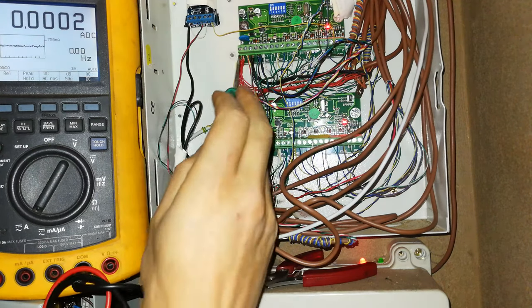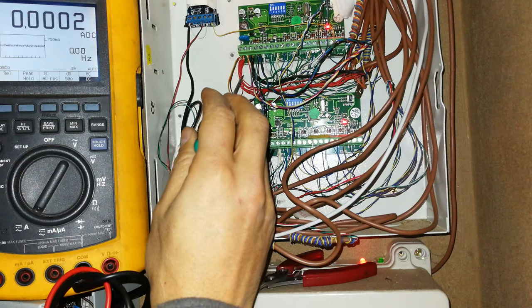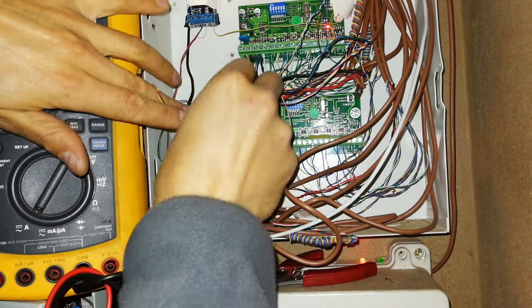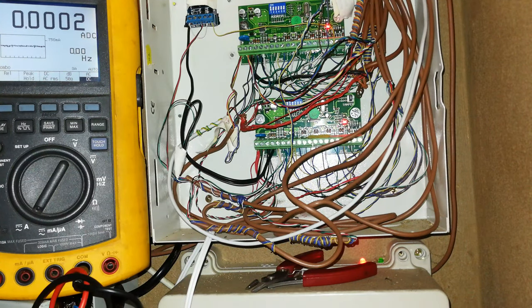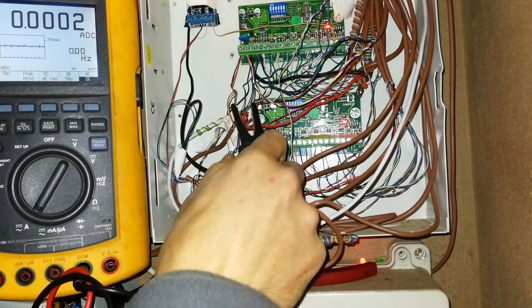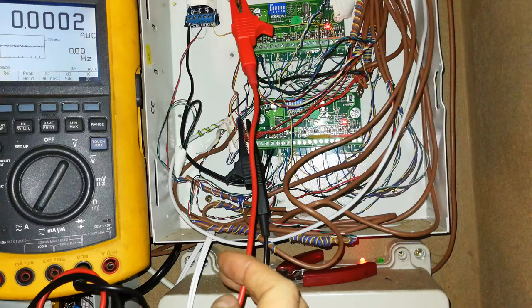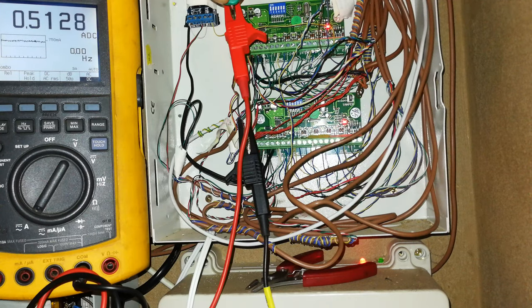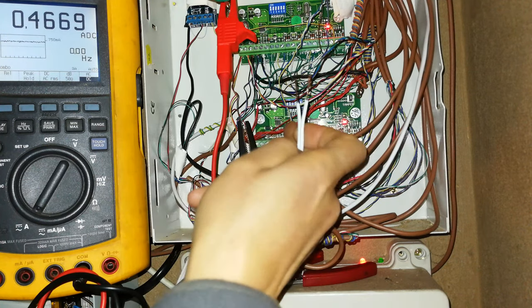So now I'm going to separate the loads. You can see there is a load and there is a load. I'm going to grab all these red wires and actually just measure what the load from all these sensors is. I'm going to unplug that and grab those red wires. So what I've got here is a complete bundle of positive wires coming from at least eight different sensors. I'm going to measure the current drain on those. I'll connect it back to the positive — I've opened the circuit — and look at that: 0.5 amps. So right there I've found 0.5 amps which I can now load onto the other battery bank, sharing the load and giving me double the backup time. I'm going to quickly wire that into the other battery bank.